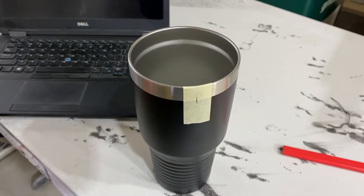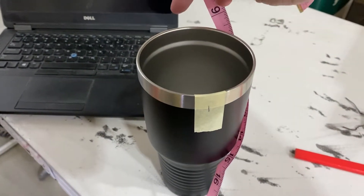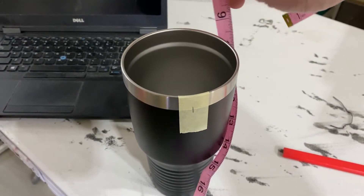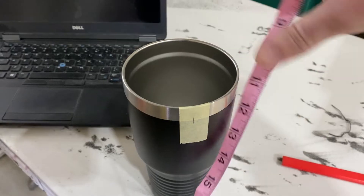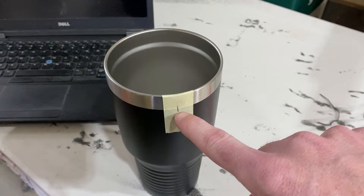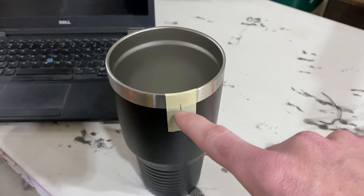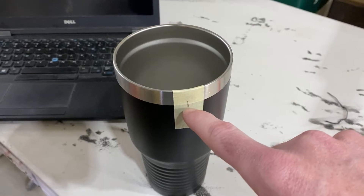Got the bed lowered and the rotary in here. Go ahead, take the wire, plug it in — and that's it. Now if I go up to the controller and hit the buttons for the Y-axis, we'll see that the wheels move. The next thing you want to do is take a flexible tape and measure the circumference of the cup, so we can tell the program to spin the cup all the way around back to the start point, and that will help us determine whether our steps are right.